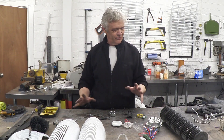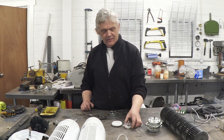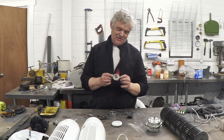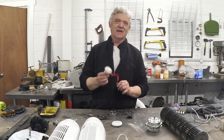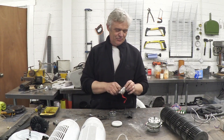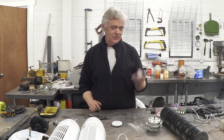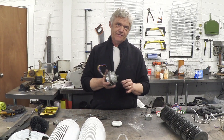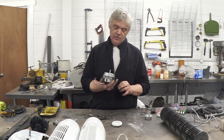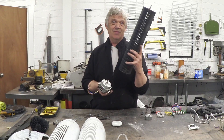It's not a heater, it's a fan — and I'm really pleased because there's a huge haul of cool bits in here. There's a nice on/off switch, a selector switch, and a timer mechanism — a little bit of clockwork that runs for one hour. If we stick a tiny motor on that, we can run it for an hour as a kind of battery. There's a nice capacitor, a synchronous motor we can make into a hand-crank generator, a squirrel cage motor from the bottom of the fan, and the rotor — which is the bit I'm interested in.